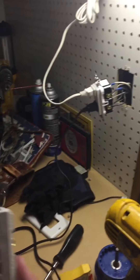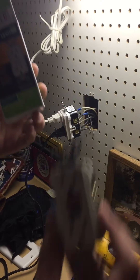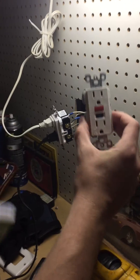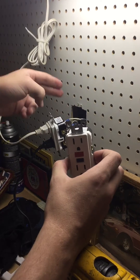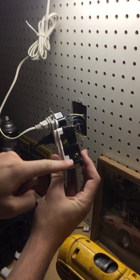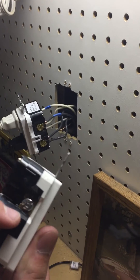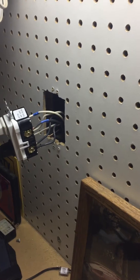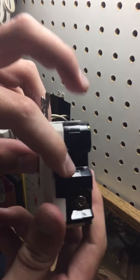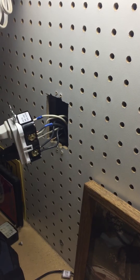Where's the box so you know which one it comes in? The box looks just like this. So the major difference if you want to set these two up: if you ever look into your cables in the back, you've got your black wires and your white wires. Black wires connect to gold, white wires connect to silver bolts. Make sure not to get those switched up — gold with black, white with silver. That's the first thing you want to make sure you do.